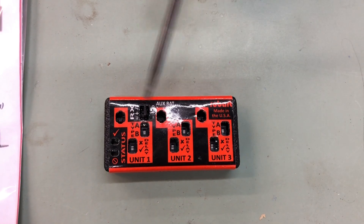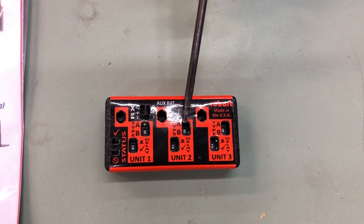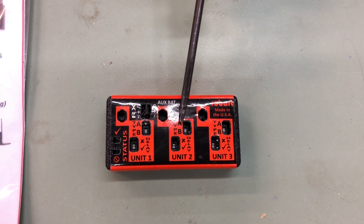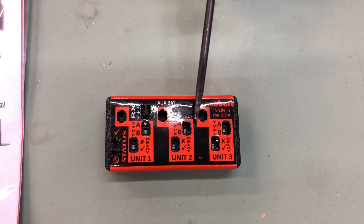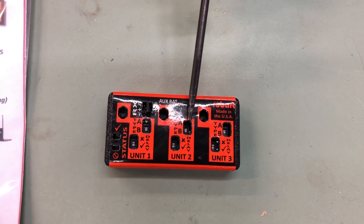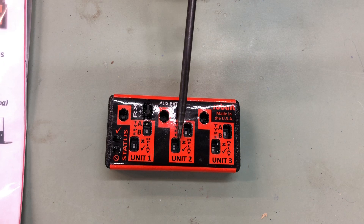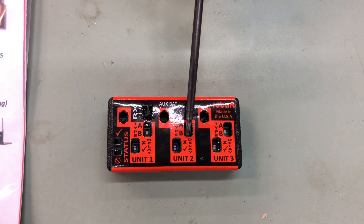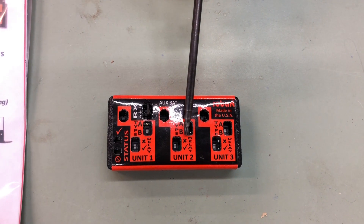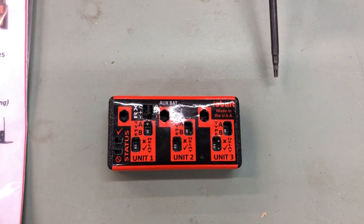Your retract will plug into the top one here. Type A or B in the middle — an easy anagram for that is B is for big. So if you have a giant scale retract, make sure your dip switch in here is on B. The bottom is a delay unit or delay switch. X means it will not delay; the check means it will delay.